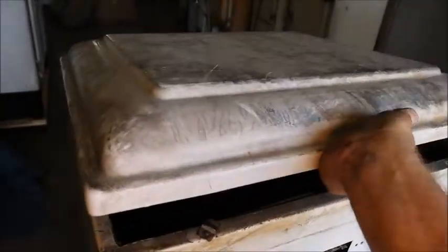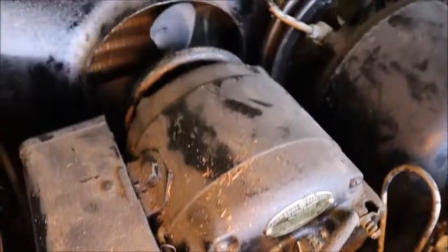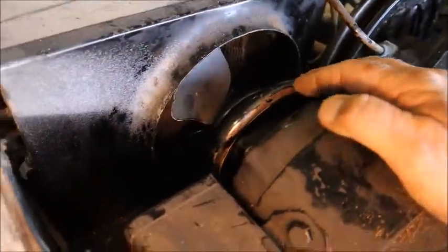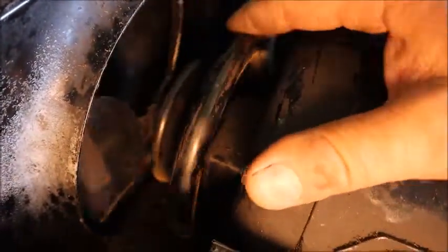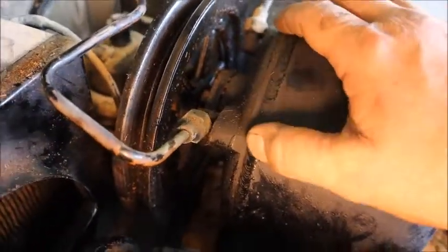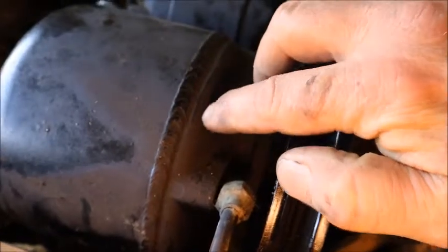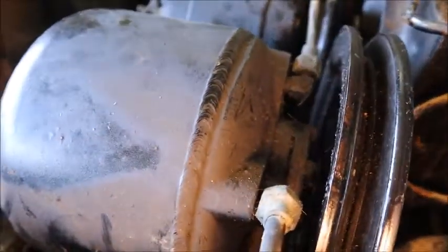Let's take a look under the hood. It's clearly an open drive or belt drive. The motor itself has a flywheel, a pulley, and a fan. The compressor is a welded case belt drive compressor — that is definitely not something that you see. You've got a dome on it just like you would on an electric hermetic compressor, welded into a base plate. But there's a seal carrier with bolts on it — so definitely a hermaphrodite design for sure.